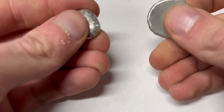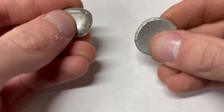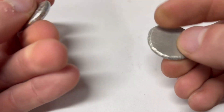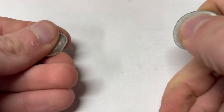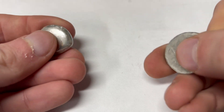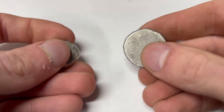The process of work hardening is a very useful one. It was used in the days of old when bronze tools were used. Bronze is a very weak material and likes to bend a lot. By hitting it and working it a little bit, you can work harden it, making the crystals damaged, allowing it to stay sharper and harder for longer.